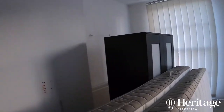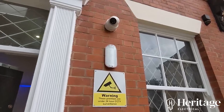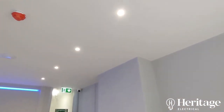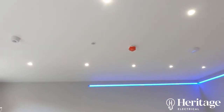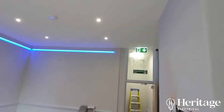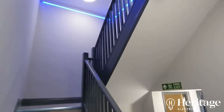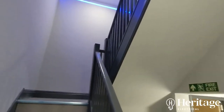You can see there's a lot of work to get this up to scratch. So this is where we are pretty much finished. You can see we've installed Hikvision CCTV cameras, we've got emergency lighting outside, everything that needed to be re-plastered has been re-plastered and painted. The initial entrance has been knocked through to make one big communal room. We've got some standard Collingwood H2 spots in here to provide the functional light, and we've chased some plastered LED trim into the wall — or cut it in where it's stud wall — which has then been plastered in to look like part of the wall, with RGB tape installed.